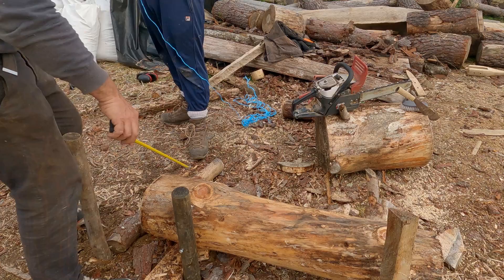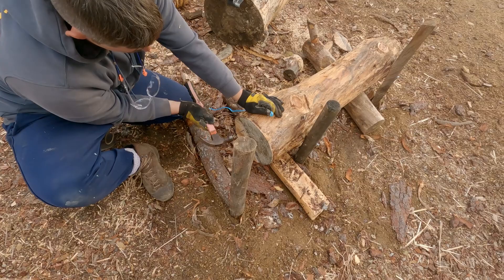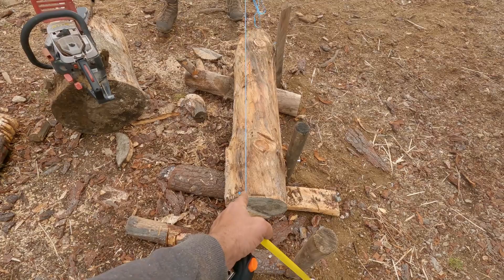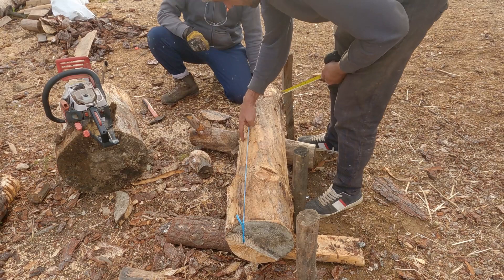Now you want to set up your guide. Your first cut is going to cut off the ends, so go about an inch in. You can measure them out with two, three, or four lines and go to the other side, then set up the guide for every single cut. But what I like to do is just set up the first one and cut about an inch away from the guide — the first slice is wastage — and then I take the guide away and use that cut edge as a guide for the next cut.